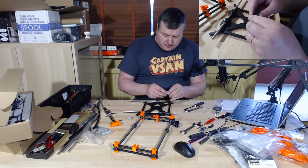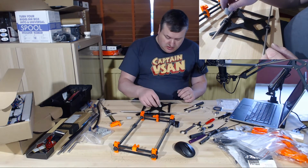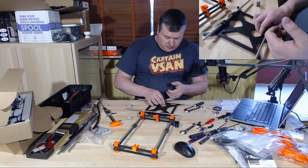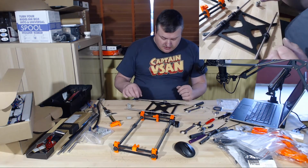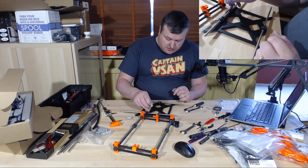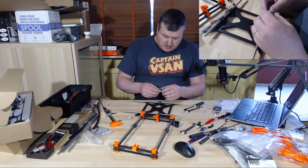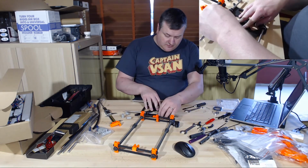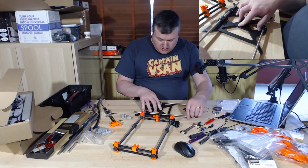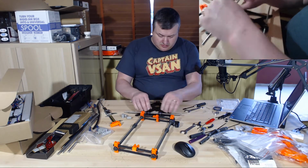So I just wanted to try them out because people have been using those without the aluminium shield on the Y carriage, and because of these U-shaped fasteners, the compression is more dense than the zip ties that were used before. So I definitely wouldn't use those plastic bearings with those fasteners, because they just collapse under the tension, and then the rod is fastened. Now with the screws reasonably tightened, the rods are smooth, and this one here is a little bit stiffer than this one here because of the two bearings, but I think I got them lined up quite right.